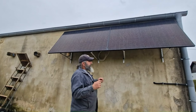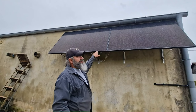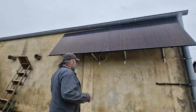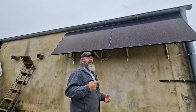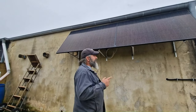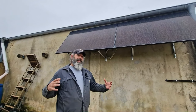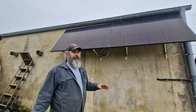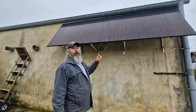The system basically plugs together like an extension cord — the panels plug into an inverter, and the inverter plugs into the wall just like a coffee pot would. Germany allows this for two reasons: one, it is plug-and-play with no exposed wires and no electrician needed; and two, 800 watts is not a lot of power, so at maximum we'd only feed back maybe three or four hundred watts to the grid.